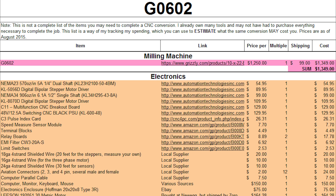I'm using terminal blocks for my power in — I have 110-volt and 220-volt coming into my box, and those both go into terminal blocks. I got a 5-pack for about $5. The EMI filter is for the VFD — some people say VFDs create a lot of noise on the input, so you want a line filter ahead of the VFD. Then there are limit switches, and different gauges of wire: I use 18-4 shielded for the stepper motors, 16-4 for the three-phase motor. I actually went with 12-4, which is super overkill since this motor only pulls about 3.5 amps.